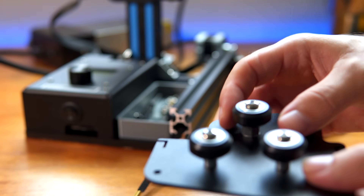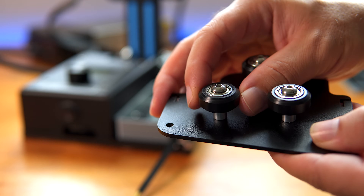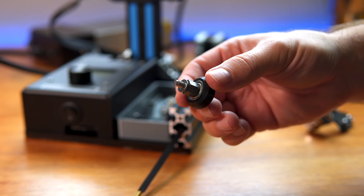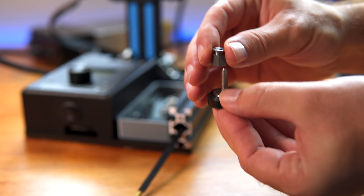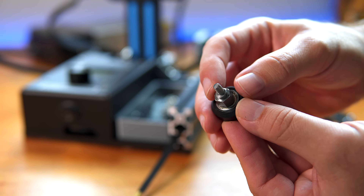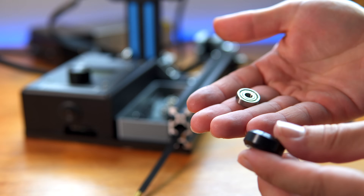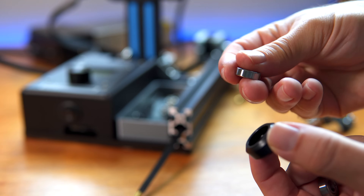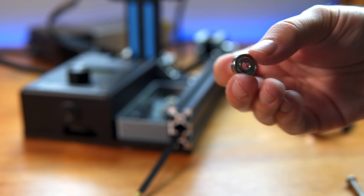This one's the worst — the one that's adjustable by itself. The dual ones are still moving but barely. I got the worst wheel out and here you can see it's the adjustable one — you can see how the eccentric nut works. The bearings just fall out of there, which is good because now we can glue them in really well where they're not moving around for sure.